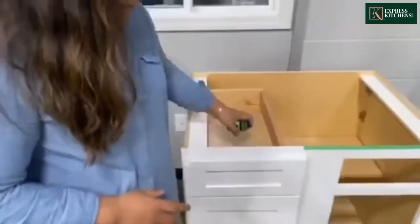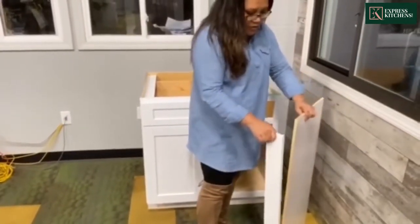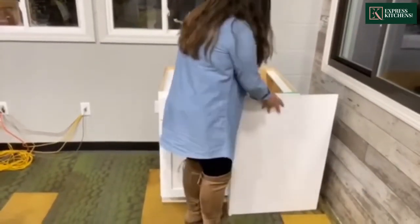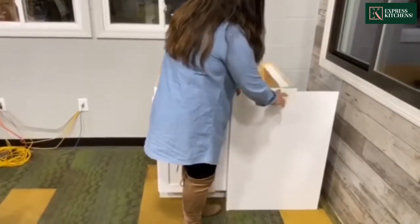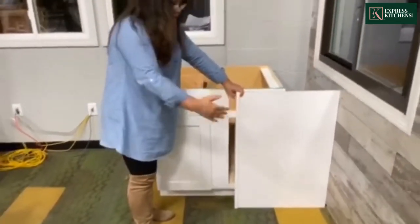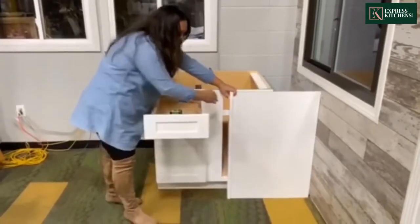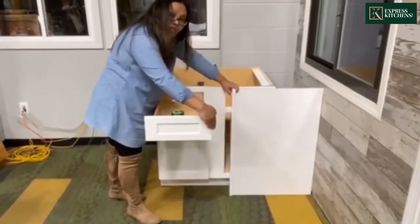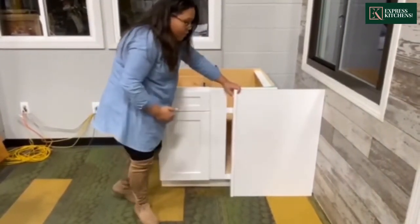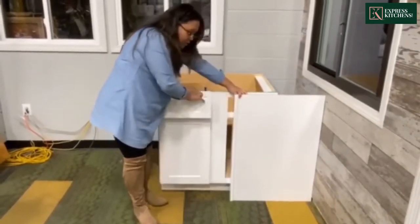What does that do? So the reason why I over pull many times, or oftentimes, is if I have this dishwasher panel here, or maybe a small cabinet, and the next item here could be a range, and a range would have a big handle here. And that's why I need to over pull, because if I had a huge handle, eventually I don't want this to touch. If I only pulled it 3 inches, this might be too close, right?